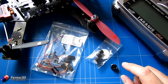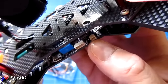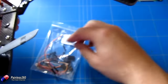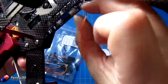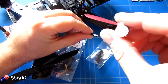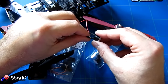Here is a close-up of the actual side of the craft — there's the USB cable, and that's where we want to plug the cable into. It's actually labelled 'buzzer' and it's clearly labelled: positive is this side, negative is this side. What we need to do is plug in the cable that came as part of the kit — any of the two-pin cables will work. Make a note of which cable is plugged into the positive side of that connector. Get hold of your piezoelectric buzzer, spot which side is positive, and just pop the lead on. Similarly with the other side, just pop that one on and you have the buzzer wired up.